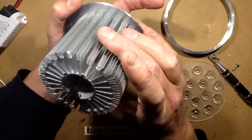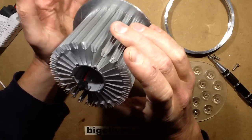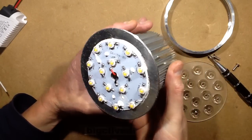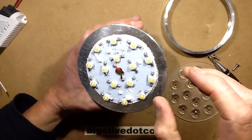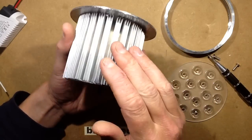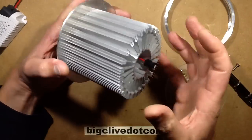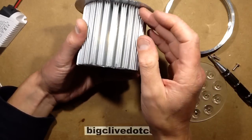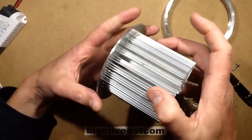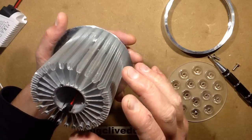How is this heatsink actually fastened on? There are three screws centrally behind it — they must be recessed. I'm not going to pull this off because it's just going to be gooey and sticky, but that's all that appears to be holding onto this heatsink plate. So ultimately, most of the heat is being transferred through the centre — it's not as if these fins were actually bonded directly onto that, so there's possibly a slight air gap. The only place it's going to be really making good connection is at the central core, but that's still going to work.